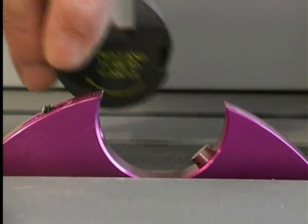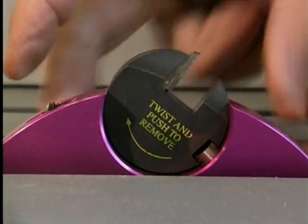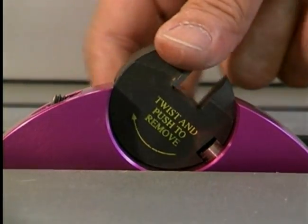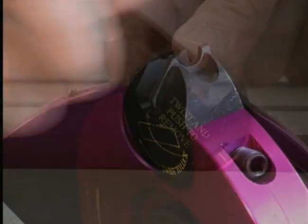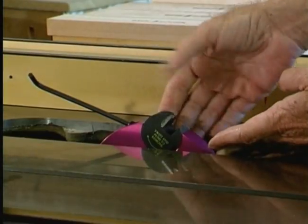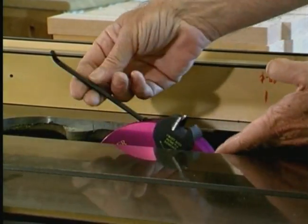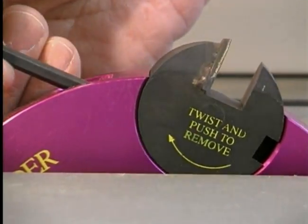Do not force the plug into the cavity. Gently slide the plug over the pin to its maximum depth. Twist the plug into the lower portion of the L-shaped groove until the plug stops in its final position. The next step is to index and lock the plug into place. Tighten the set screw down into the hole of the plug.